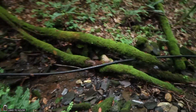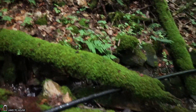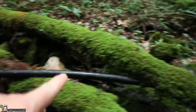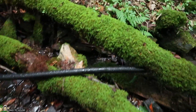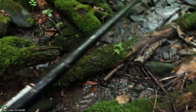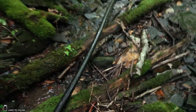We've noticed that there are a few places in the penstock that have an upward raise to them. For example, right here the pipe dips down, goes back up over this log and then back down. Whenever that happens, a pocket of air can be trapped and it can actually reduce the efficiency. So I'm just going to simply bring this down a bit so that every part of it is going downhill.